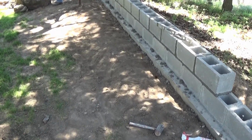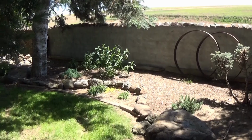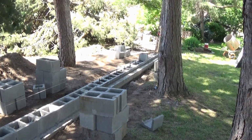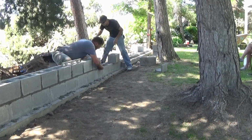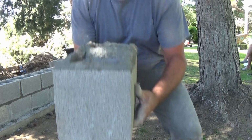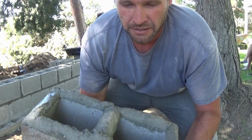Well, here we are at Mom's Wall. We'll have a masonry mortar finish to match that wall. 2x6 footer. That'll get buried and covered up. Down to the tree. Whenever you can back butter your brick like this, it's superior to all other methods. That is superior.